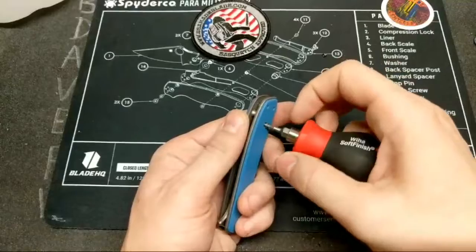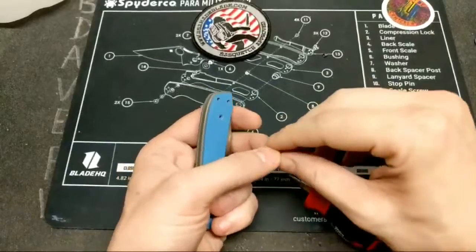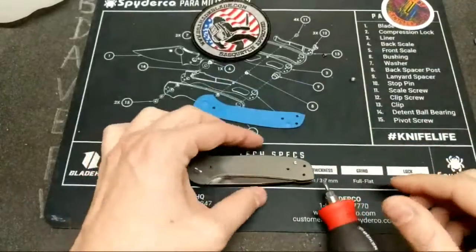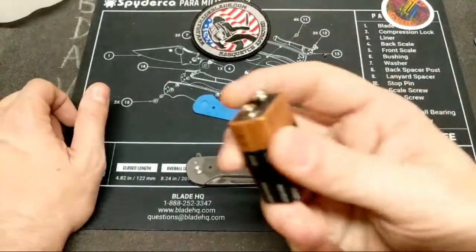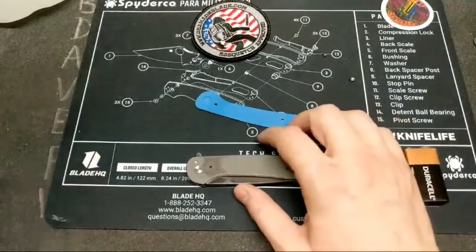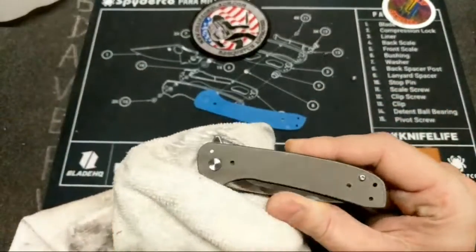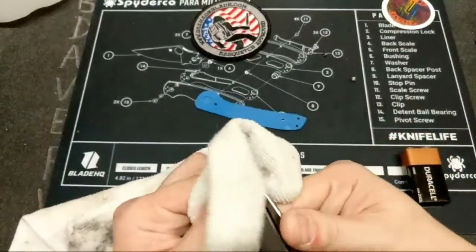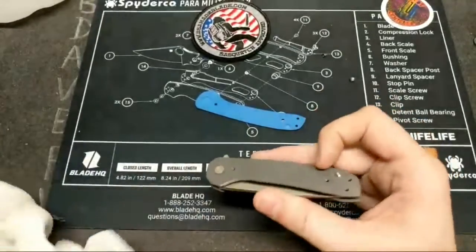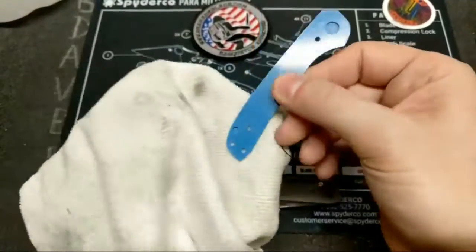Yeah, the anodizing is actually pretty easy. I forgot, there's a guy on YouTube, he has a video of anodizing with 9-volt batteries, and that's what I'm basically going to use. To get the bronze, you really only need one 9-volt, so I'll show you me doing that today. Hoping to get a power supply at some point, because you need to get green. If you ever want to try to get green, you got to go very high. You got to have, if I remember right, like 12 batteries. And those 9 volts can get expensive. So hopefully I can get a power supply in.